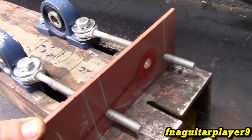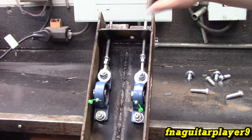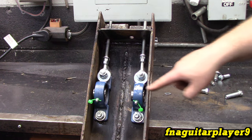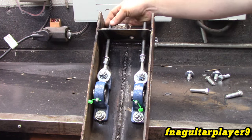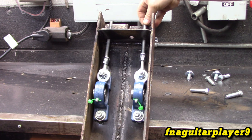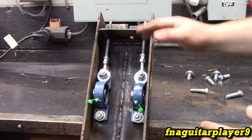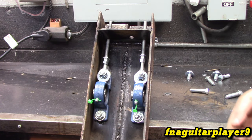I've just got this piece welded in - pretty good weld. I'm just doing a temporary setup; it will be taken back apart to paint and for initial assembly. Imagine the shaft is through here - it's not in just to make it easier to move. Since these bearings are self-aligning, that will allow me to adjust one if I need to for tracking - which is the angle of the blade on the wheel. I get complete adjustment from the nuts on these two bolts, which are mainly for alignment and to help hold it in place.